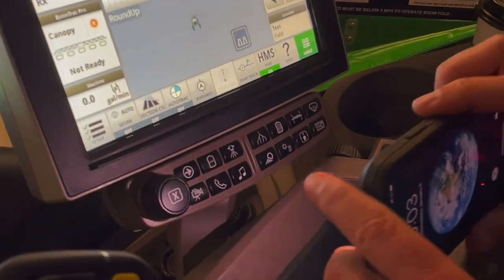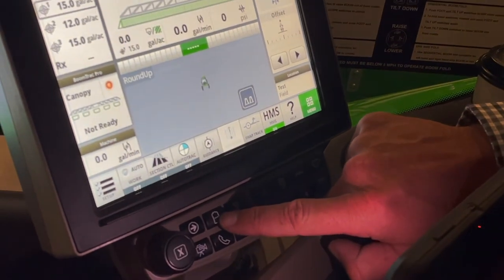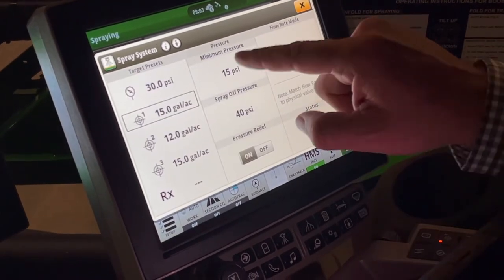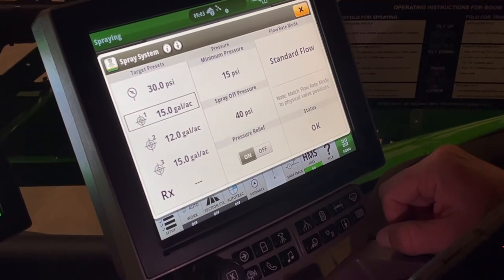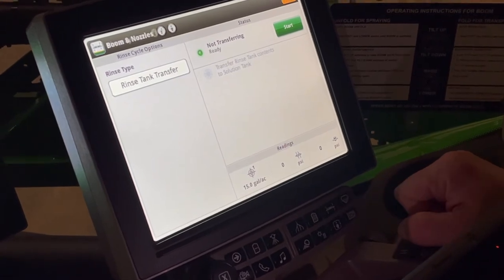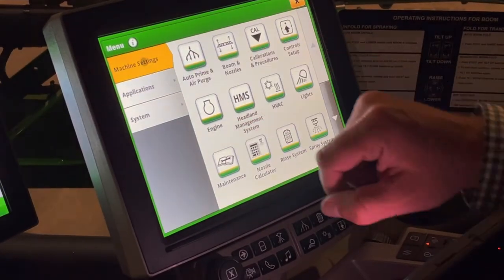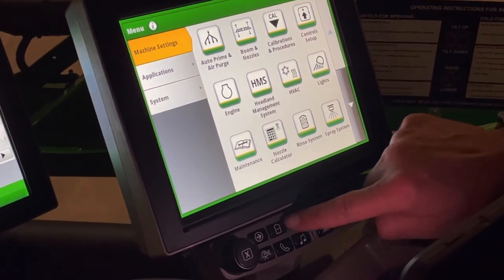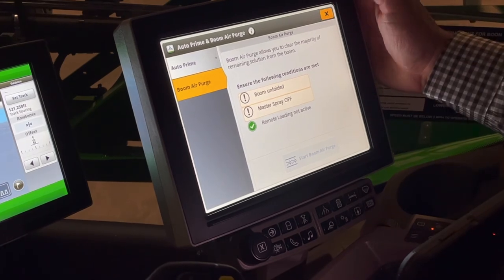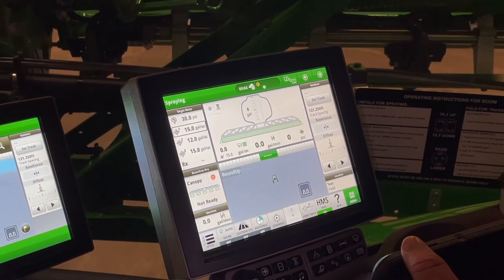If I look at our monitor down at the bottom, I have quick buttons, and anything on these quick buttons takes me to the pages we've already seen. The first top-left one takes me to my tank system where I adjust my agitation level. The next is my spray system — where I change standard or high flow rate, minimum spray pressure, etc. Here is my auto prime and air purge, my rinse system page, and my boom track page. Basically all the main spray options are right here on my shortcut keys. As I spray in the field, I find that I use the shortcut keys more than anything else on the monitor. That's your overview of the Gen 4, the new Spraystar Gen 4 display — appreciate you tuning in today.